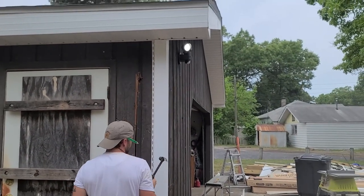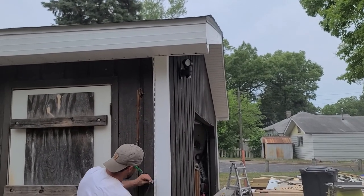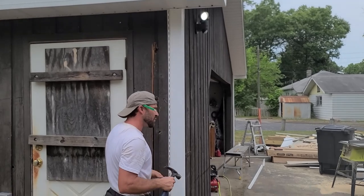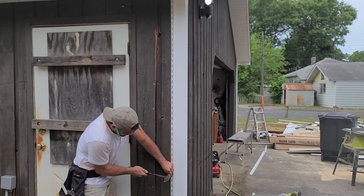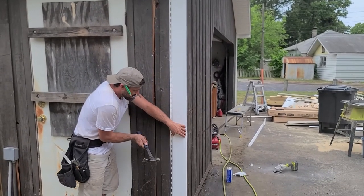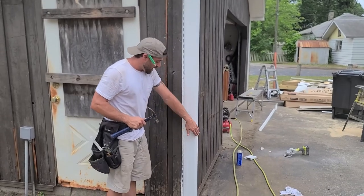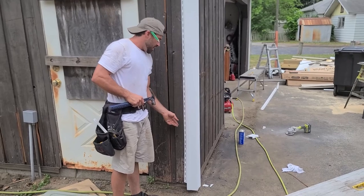There's a couple different ways you can pull that line. If you use your tape measure and just try to pull from the corner, you have to make sure you pull from where the center of the corner would be. So you can get off if you have two pieces of plywood that don't fully touch or something like that. I actually just discovered that using a framing square really helps. It's got marks on there for you, so to keep it square, it'll have your exact point of your corner represented already. And you can make your marks on it.